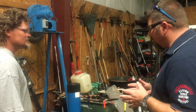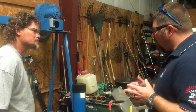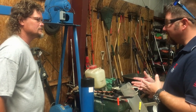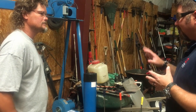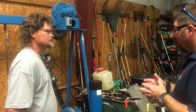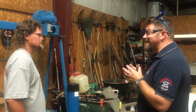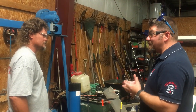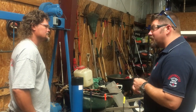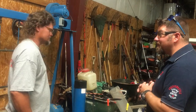People ask us a lot, and there's a forum site that we're on called scubaboard.com, and they ask us all the time, why do dive shops visual after the hydro does the same? We try to explain to people, it's the hydro company's license, just like we're licensed or certified to do certain things. But once it comes back from y'all, for us to put our stamp on it, our sticker that says it's visualed, we have to make that same visual inspection. So we basically do the same thing that you guys do. It's just so that when we give it back to the customer, we're certifying that this tank is good to use.